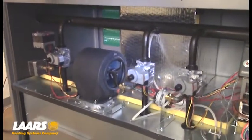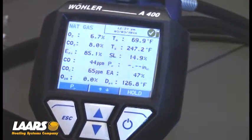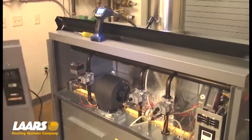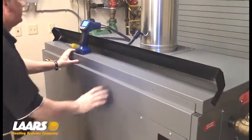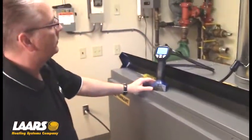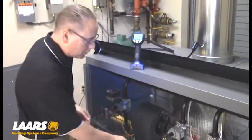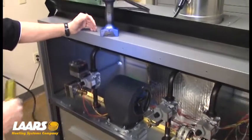Up here we're looking for 8% CO2, which is what we have. Lastly, if you have combustion air ducting coming into the boiler, put the cover back on the boiler, slide it up the grooves, and get your reading. The reason is: if you have hypothetically 50 feet of vent, you don't want all your combustion air coming in from the front cover — you want it coming down through the vent. Because our CO2 is at 8%, I'm actually going to put this out of range a little bit by opening my air shutter slightly. We'll wait for the analyzer and then I'll show you how to go back in and readjust it. Be patient with your analyzer — we're looking for CO2.